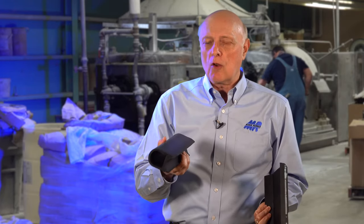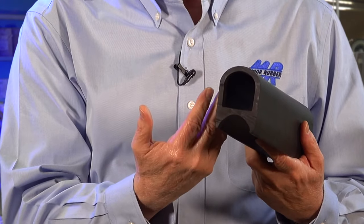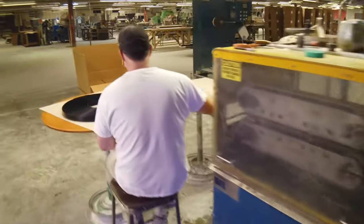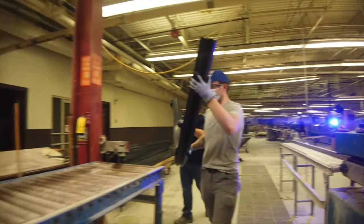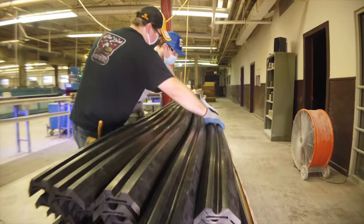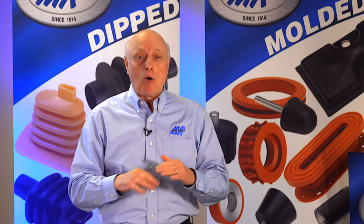What's great about extruding is that we can take a profile and produce it in 10, 15, or 20-foot lengths. The cost of tooling is negligible — we have an EDM where we make our own tooling in-house, and it's not a profit center. We can make a die like this for $350, and that's your total tooling cost. We can run anywhere from 500 feet to 25,000 feet at an economical price with quick turnaround times, and we can run small quantities. Order sizes for production can be anywhere from $500 up. So you could start off with a part never made before, come to us, and the die is $350 with a $500 minimum run on a standard compound — for less than $1,000, you go from nothing to a production part. We always say: let all your rubber problems be minor problems.